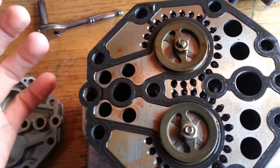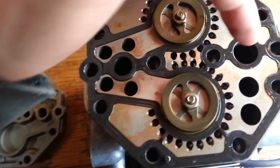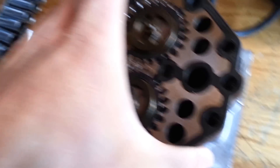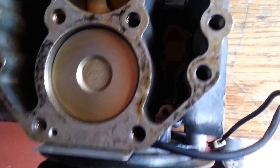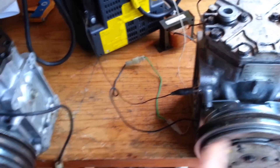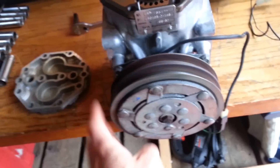It's two-piston — they're 180 degrees out of phase. This would be the discharge side, and this would be the suction side. It actually draws vapor down into this sump, and these small holes here are for the suction. There are two pins that keep this aligned properly. You can see the sumps there — for any oil that gets returned, there's a small hole down there that actually feeds the bearing from the front. The construction of these is essentially the same internally, everything except the head. The suction and discharge are reversed on this one, so that small hole is on the other side.